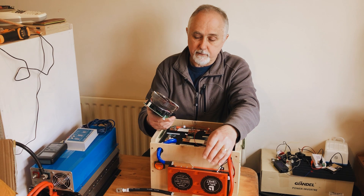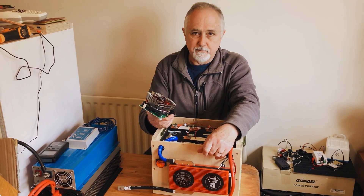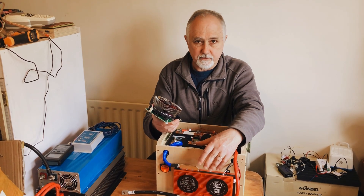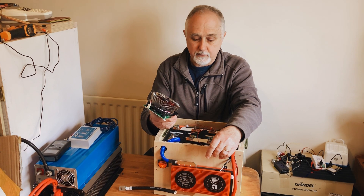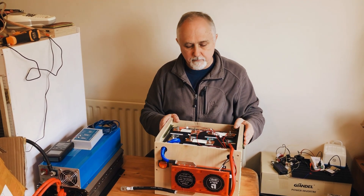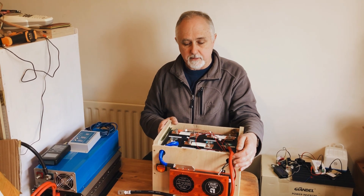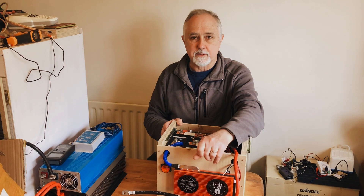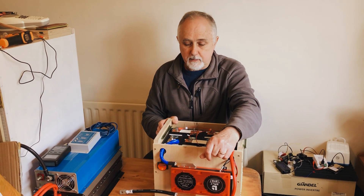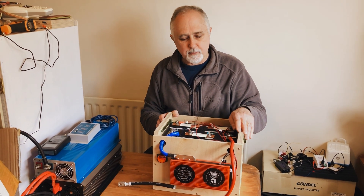That gave us two tests of approximately 285 amp hours — roughly five percent short of the 300 amp hours stated, and actually much closer to a 280 amp hour battery. We then did a high-capacity test using a smart shunt, and that came out remarkably similar: roughly 284 amp hours. So all three tests showed that this battery was not up to its stated capacity.